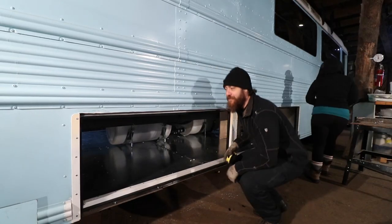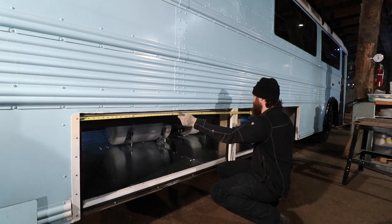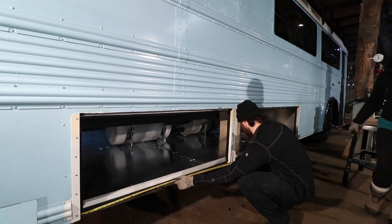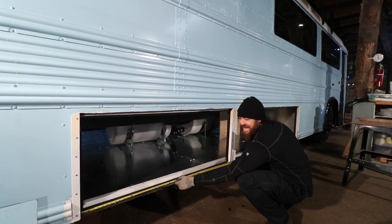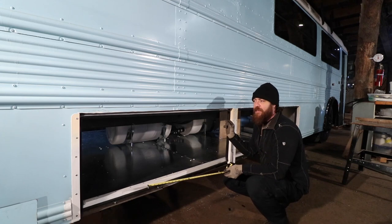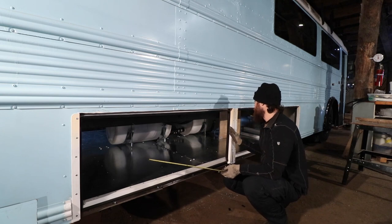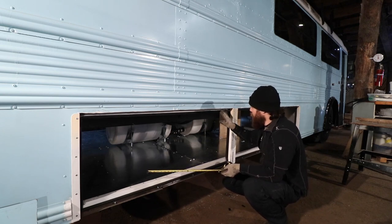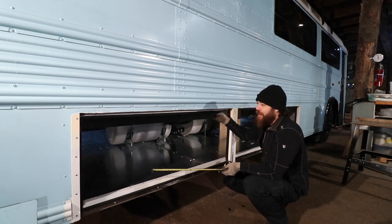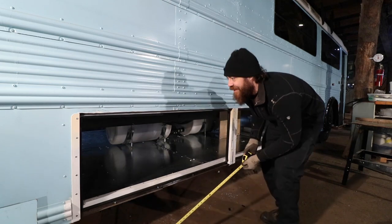For the doors, like with everything that we do, we need to measure. The absolute measurement: we have 54 inches on this one and 53 and 15 sixteenths on the other. So we're going to make these doors a quarter inch smaller than the opening — that way there's about an eighth of an inch on each side for the door to actually travel. That'll give us plenty of space to press against the weather stripping we've masterfully crafted around this opening. I think it's going to seal real nice.